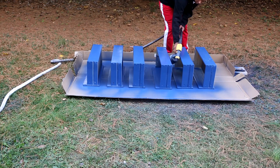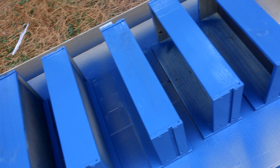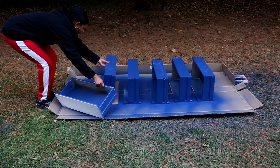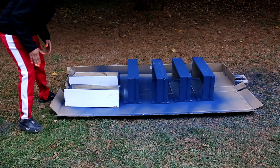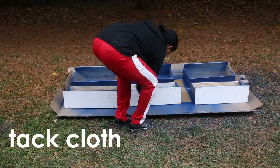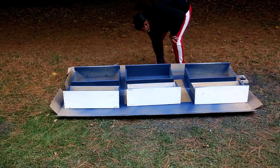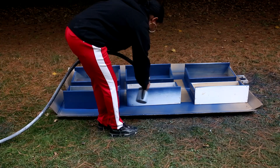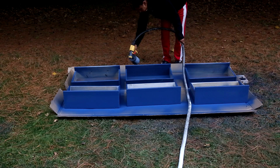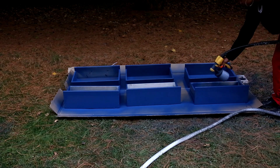Using tack cloth is one of those things that really makes a difference when painting dressers and furniture. Here's just a quick look at what the dressers look like after the first coat. Once the sides and back were done I touched the drawers just to make sure that there were no wet spots on the outside, and then I ended up turning them over to paint the fronts and the insides more thoroughly. I like using tack cloth a lot — just wiping away any tiny particles that may have settled onto the wood. For the front panel of the drawers I made sure I did the edges first to make sure I didn't forget the sides of the drawers. Those areas I feel like can be missed occasionally, so I did do that first. Then I went over the front part of the dresser drawers with the same process of that smooth, even motion.